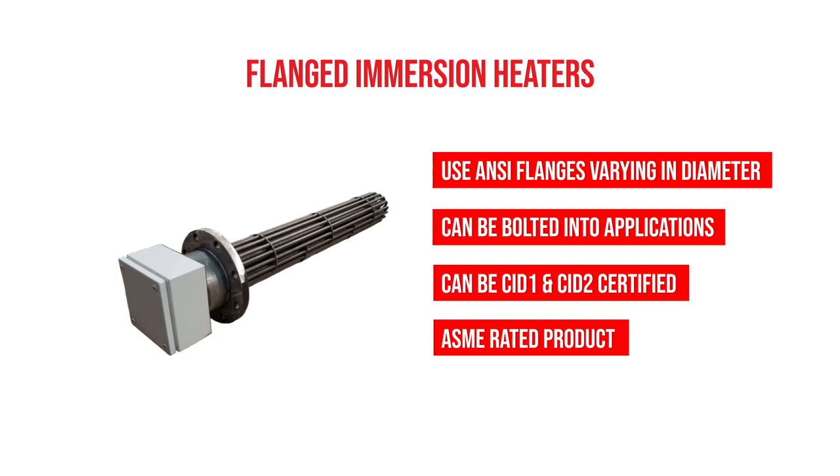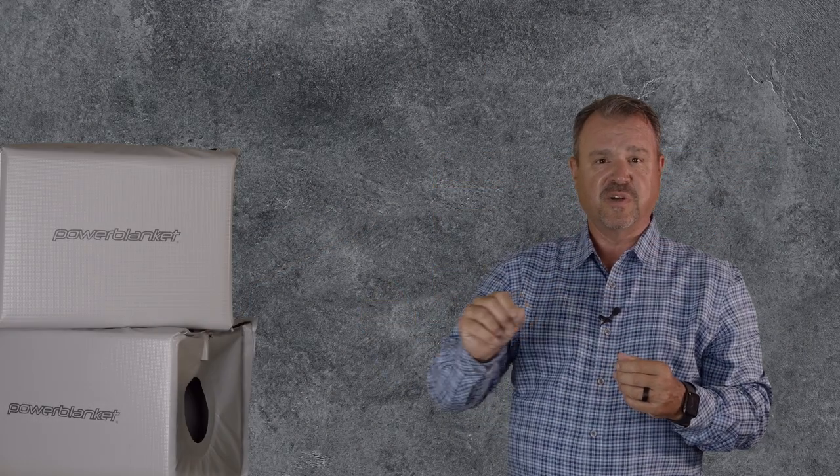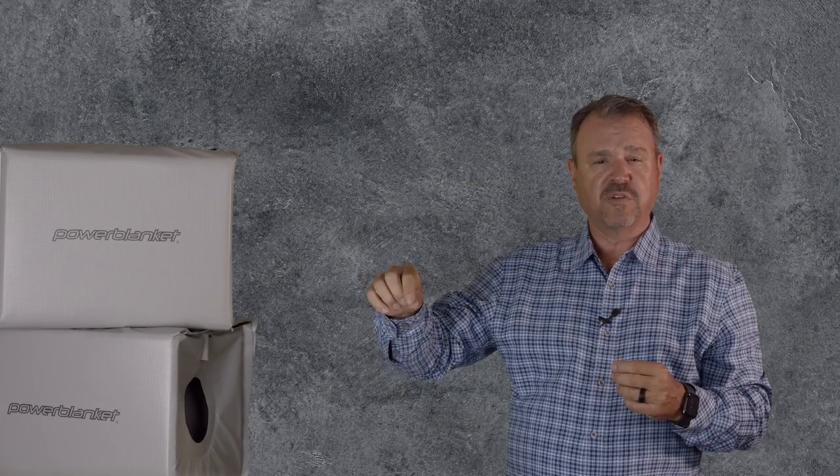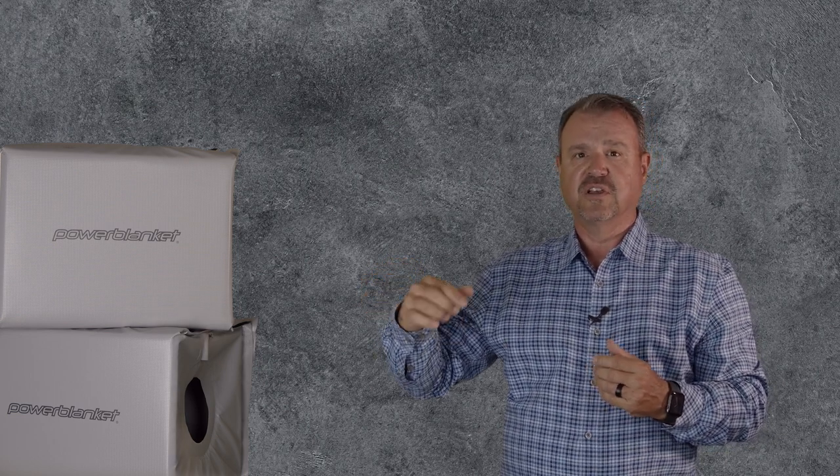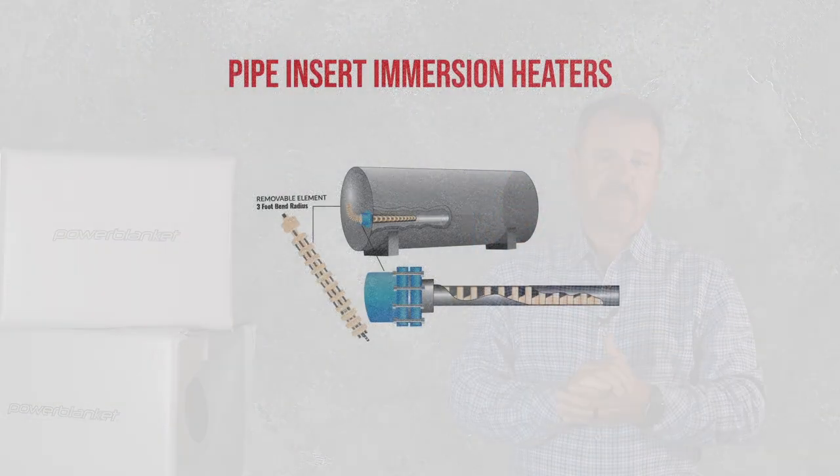These heaters often deliver a great deal of heat in a short period of time. So one of the things that's most important on these heaters is the protection of the heater from runaway or over temp protection, and they'll almost always build an over temp thermocouple on the surface of the heater so that the end user knows that the heater itself doesn't overheat and run away.